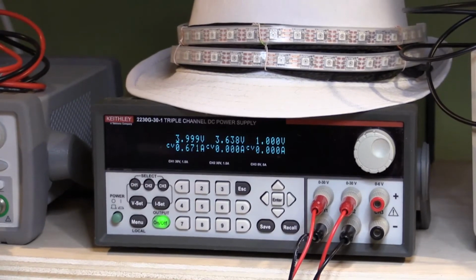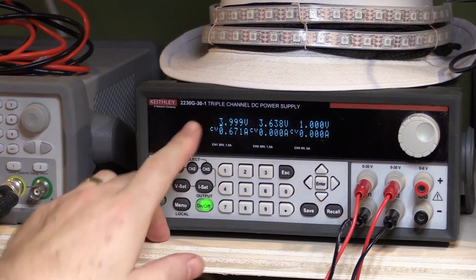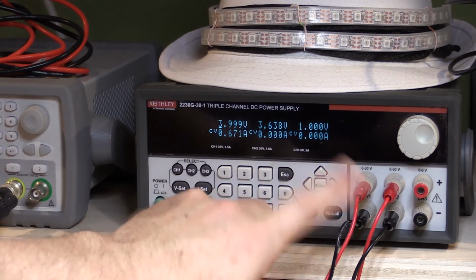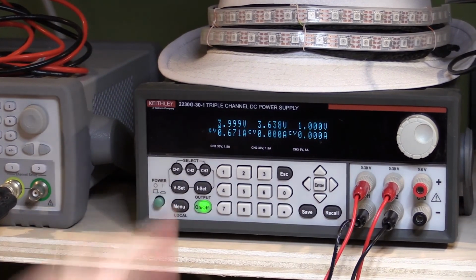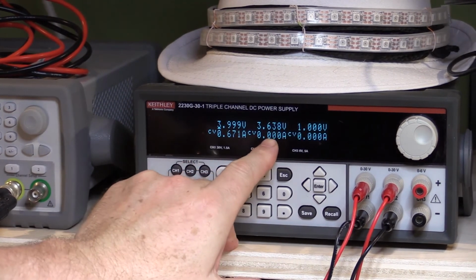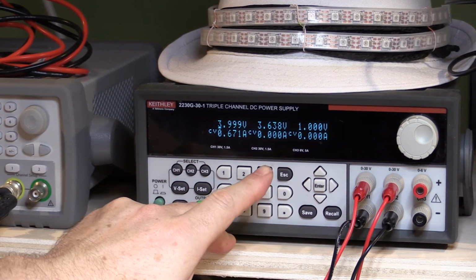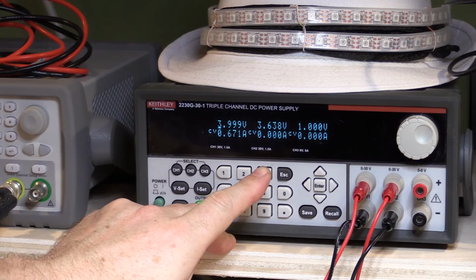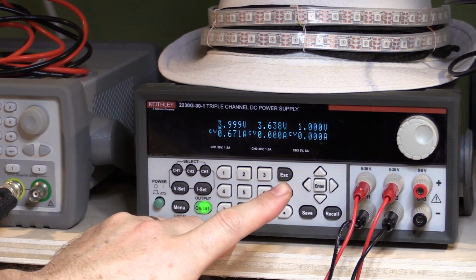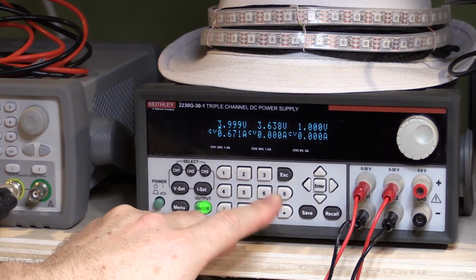What I'm going to use is a Keithley bench power supply, which is supplying 4 volts on its output right now, and I'm using the second output. It's a triple output power supply. The first output is providing the input to the Richtek DC to DC converter. The second output is used for the gate voltage of the FET, because I don't have a proper control circuit built yet. As I said, I'm busy doing some designs for the bench power supply project, which is a modular system, and my next video is about the output stages.